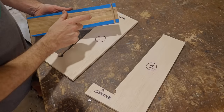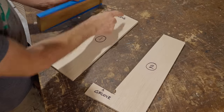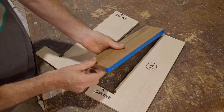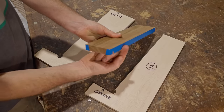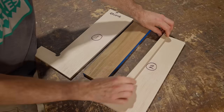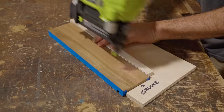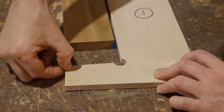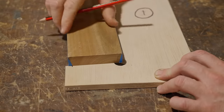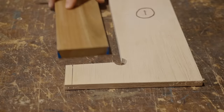Here's a quick run through of how to use the jig. The side with the groove goes face down onto the table saw, and on jig one the groove is at the top end. When using jig two to do the opposite edge, the groove goes at the bottom end. Because we've just cut a 15 degree bevel off this edge and the plywood is only half inch, it doesn't sit against there nicely — so to raise that edge up I'll nail on a strip of plywood. I also left this section too long and need to trim a little bit off, marking where to cut and setting up the blade on the table saw.